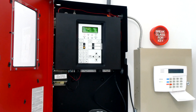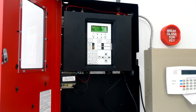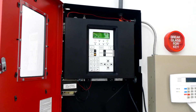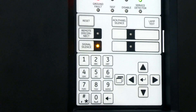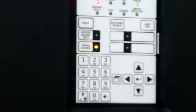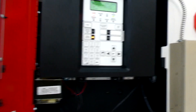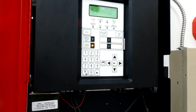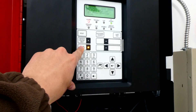One thing I like about this panel is that if you silence the alarms and something happens and you need to reactivate the alarms for whatever reason, all you have to do is press the signal silence button once again. Not all panels have this feature. If you needed to reactivate the alarms and you didn't have this panel, you would simply pull another fire alarm or activate the drill button or something like that. But for this system, it's really easy. Check this out.